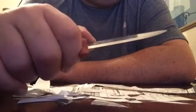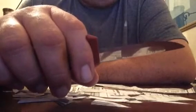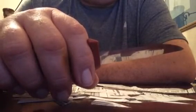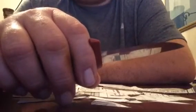But I'm very satisfied. And as you know, not all knives are made the same. Not all steels like the same angles. Not all steels like the same grits. But for a rule of thumb, always try to get your edge or your micro bevel between 35 and 40 for utility knives. Anything bigger, like big survival knives and big outdoor knives, I will go 45, maybe 50 depending on the knife. For kitchen knives, I like it on 30. It depends on the manufacturer. Some manufacturers have it lower, some a little bit higher, but 30 is what I like on my kitchen knives.